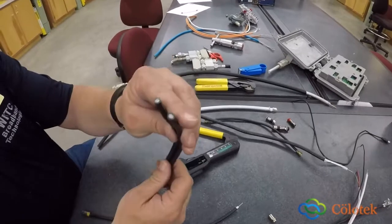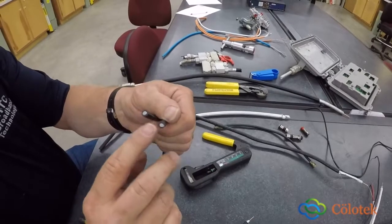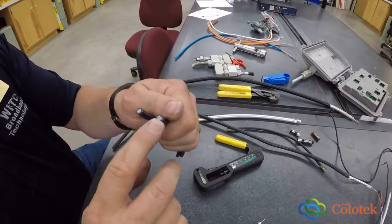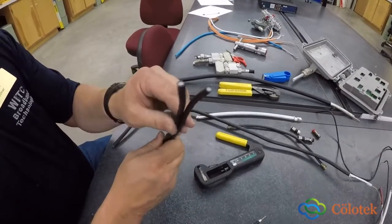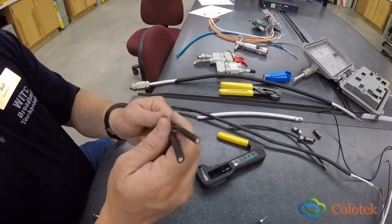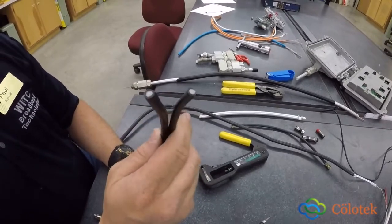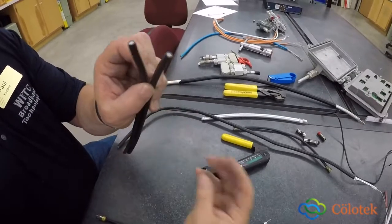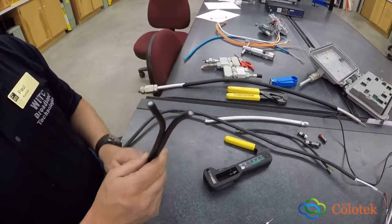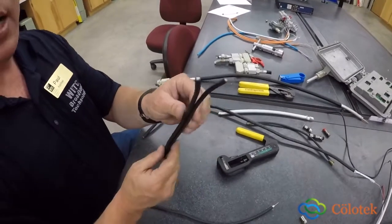The next cable I'm going to show here is another type of RG59, and once again, if you take a look at the end face, you can tell because the center conductor is smaller, the dielectric is smaller as well. But this is most often used in satellite installation. So in satellite installation, you'll have this type of cable because you'll have satellites that'll have dual LNB. And the LNB is a little device that actually syncs up with the actual satellite. So you'll have a couple different satellites that your service will connect to, and that's why we run a dual coax.